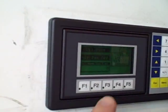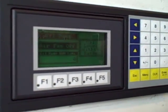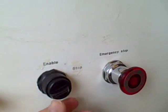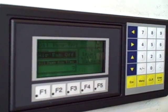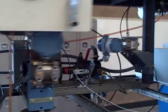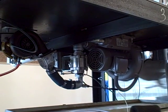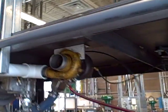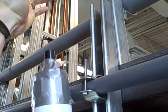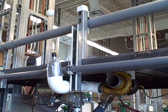On the HMI panel, you can see presently we have oil level within range, and we're showing the oil pump and the air fan off with no run time. I'll pull out the emergency stop button, make sure it's out, turn the switch to enable, then press the start button right here, and you'll see it start up. What you hear is the oil pump running — soon you'll hear the air fan turn on and the air valve open. There's our ping-pong ball.